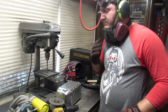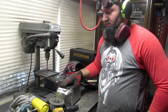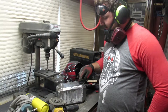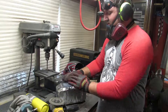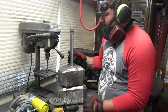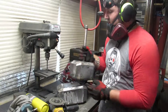Now that it's ground down mostly, I'm going to go over it with the sanding pads to clean everything up and make it easy to see all the different pits. I'm not going to worry about the pits on the edges because another thin layer of steel gets wrapped around this middle part to add a step right here. That step goes around — that's another layer of steel because that's how the original hammer works.